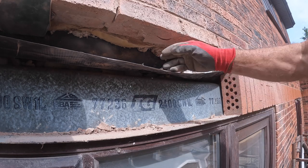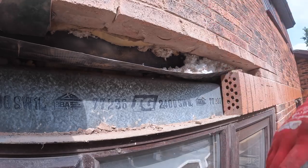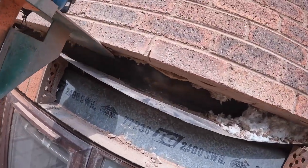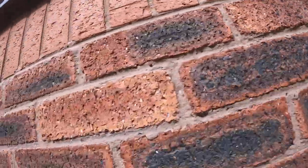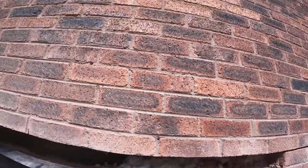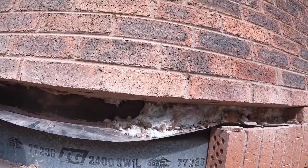And as you see, we always tuck some insulation up when it's injected. By the way, the telltale sign for being injected is, if I can find one, the round holes. Generally poorly patched, different colour mortar. So that's how you know that it's got injected insulation in it, which means you've got to preserve it.